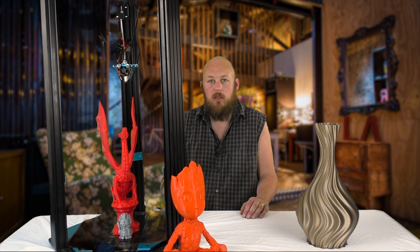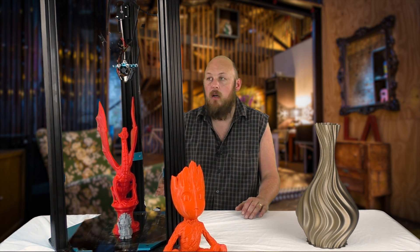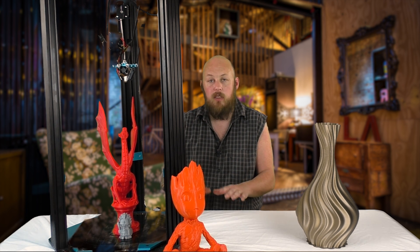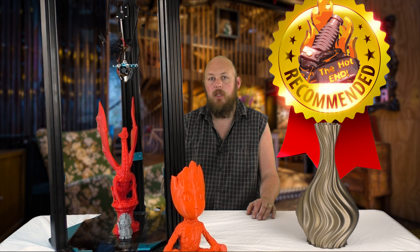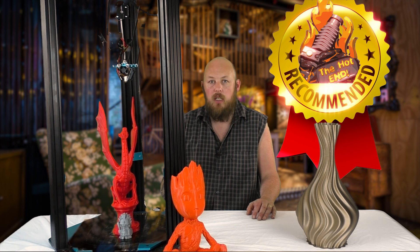I'll be doing some follow-up videos to this — this is the review, and I love it. Being that this is one of my favourite printers I've ever unboxed and built, I would have to give this a solid 8 out of 10. There are a few tweaks that could be done in the Smoothieware firmware, but that's simple because the configuration is done via a text file on the memory card. You just pop out the memory card, pop it in your computer, alter a few lines of text, pop it back in — no firmware reflashing, it just reads your configuration file straight off the card. I love this printer and I highly urge you to pick one up if you're interested in a Delta style printer or even just a printer that prints large. The quality is magnificent, the build quality is second to none, and they've really listened to the community and built something solid.